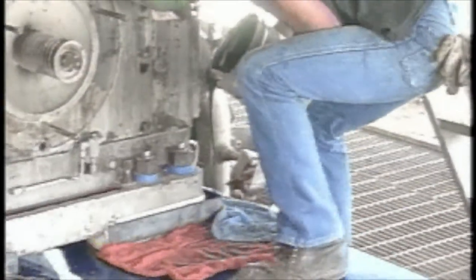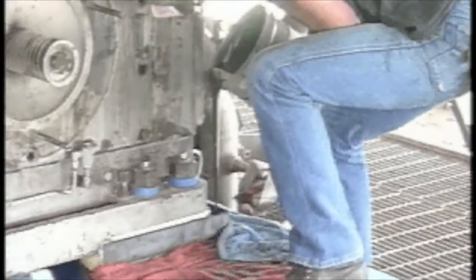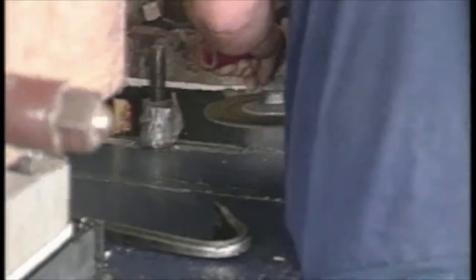Pouring epoxy chocks should always be done slowly from one point in the forms to ensure that air is forced out from under the bed plate of the machine. In addition, the special foam rubber is an open cell material that allows air and gases to be vented during the curing process. After the Chockfast Black is cured, the angle iron dam is removed and the overpour is ground off, since it has served its function as a hydraulic head during the curing process.